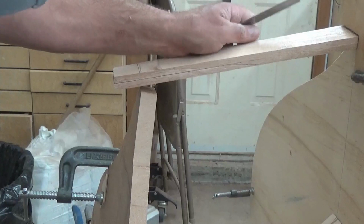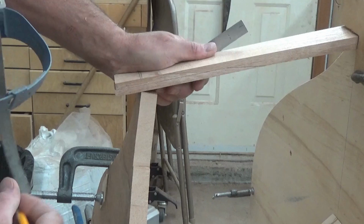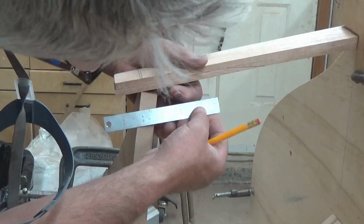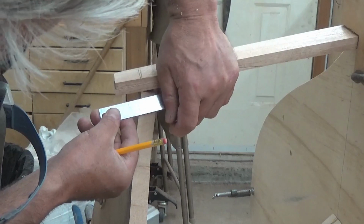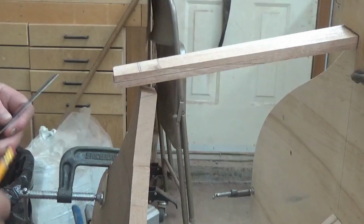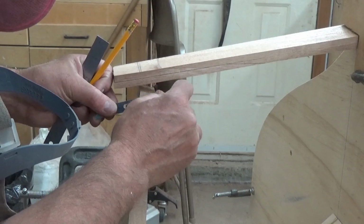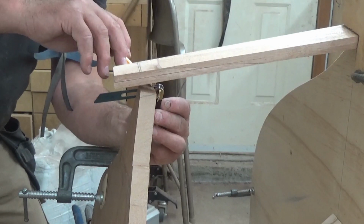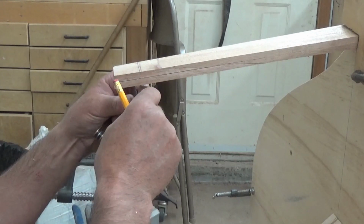With the hog at the stern end split so that it'll bend much easier, I need to now bring it down to contact and screw into the transom itself, but I need to bevel the top of the transom here to accept the hog. So I would suggest that we're looking at something like that. We'll repeat that bevel to the other side. Then I will join those two lines.